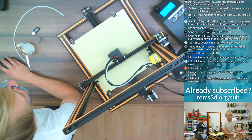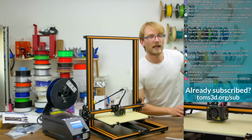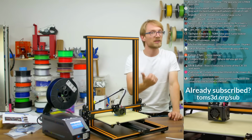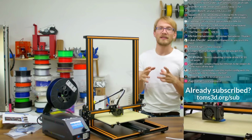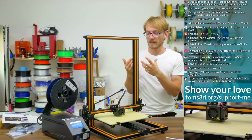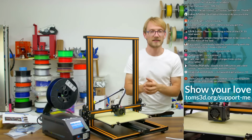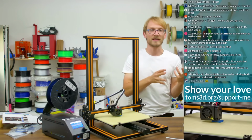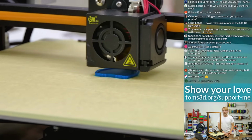Massive X 2000 is saying Semiflex is TPU, Ninja Flex is TPE. The TPE and TPU is actually the same thing. TPU is thermoplastic urethane, which is a subgroup of TPE, which is just the generic word for thermoplastic elastomer. And a urethane is an elastomer. It is an elastic polymer. So yeah, every TPU is also a TPE. TPE is just the generic family name for those.